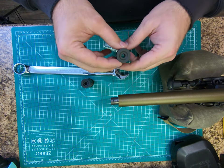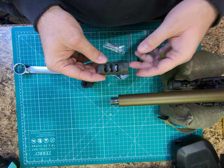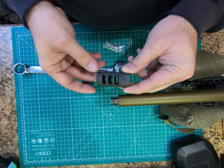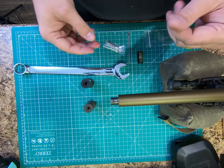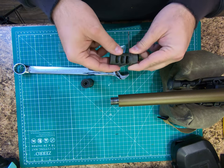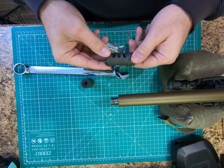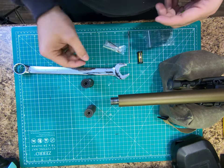Something to be aware of: once you knock that carbon off, everywhere it was is going to rust almost instantly, especially because you have it wet. There is a little bit of rust on the inside of this since I haven't shot it since I cleaned it. Don't freak out if it rusts — just take a little bit of your gun oil. I use Breakthrough — clean the rust off with brake cleaner and then wipe the whole brake down with a little bit of gun oil, and it will return it back to its nice finish. Obviously I wasn't worried about the baffles on the inside having a little rust because the first time I fire it they're going to get coated with carbon again.